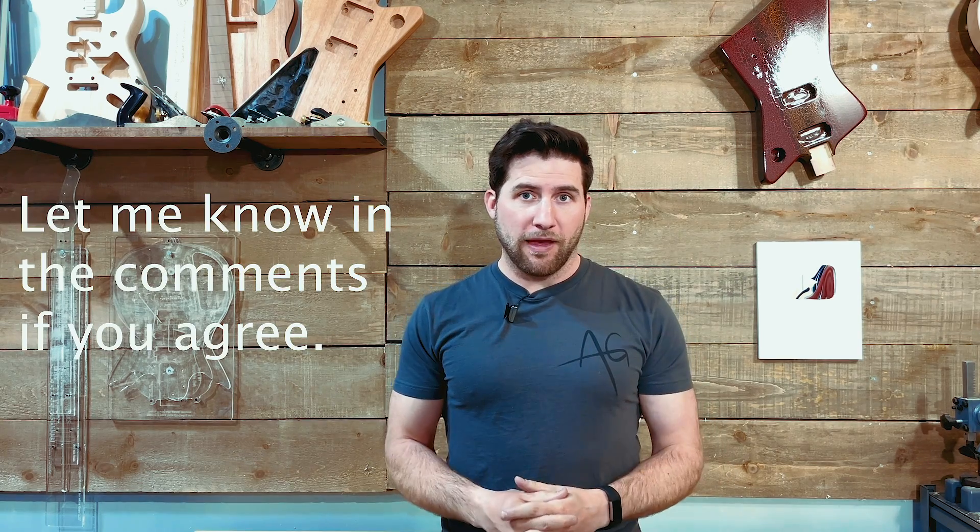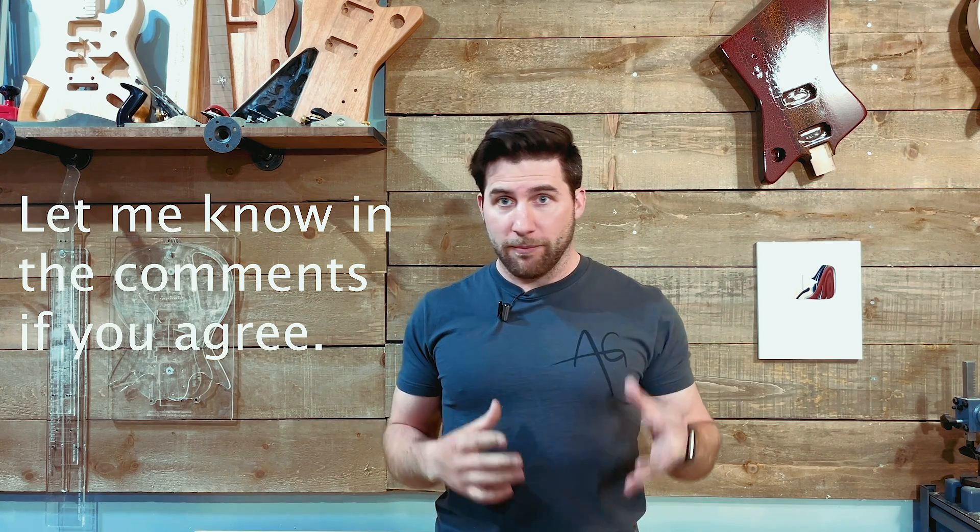Generally speaking, I think the easiest way to finish your guitar is with a wipe-on finish — something that you can wipe, rub, or buff on depending on what you're using. Within that, there are a bunch of different options. For example, wipe-on poly, available from Home Depot and probably a bunch of other places. I've done a few videos on that — including one about how to get a perfectly smooth finish by hand, applied with sandpaper, with a couple of wiped-on coats over top. That kind of stuff is very simple: wipe it on in thin coats, and eventually you can build up a nice gloss or satin finish. You can even polish them after.